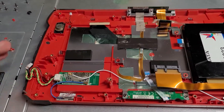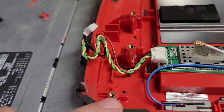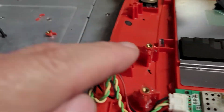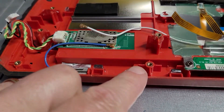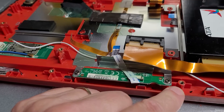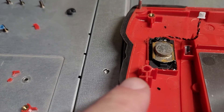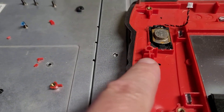This unit is set up on a series of support points. The support points have a brass fitter for a screw fitting so that it can function. But the flaw of the Snap-on design — and I've noticed this in even newer models — is that they're using plastic fitting towers to mount and secure the units. These mounting towers are made out of a baseline rigid urethane-style plastic, not a flexible plastic. What happens is — if you notice here, you see the brass ring, but here it snapped completely off. And look at all the little pieces — they come from these units.